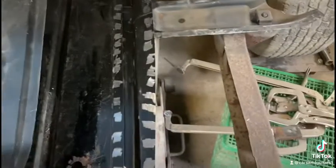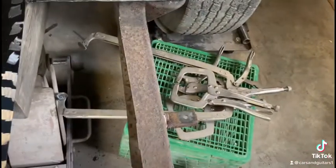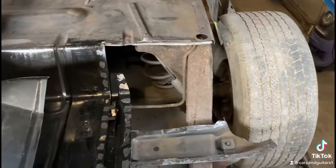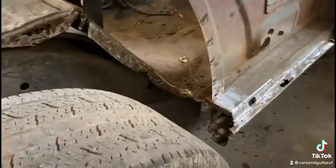And all these old cars like this, if we're going to change the body mounts, all the bolts, this is the bolt from the other side. That's what was left of it. So, you know, when you see these cars on Kijiji, people saying there's an off-frame restoration, if you don't see all new body mounts in there, they know that car was never off the frame. And pretty much all the bolts and all the mountings are going to be rotten underneath. So, something to check for when you're buying an older car that you're going to restore, or somebody's restored and got it for sale, and they're lying about having done a full restoration on it.